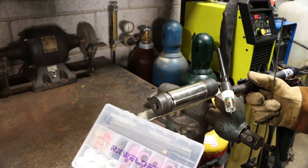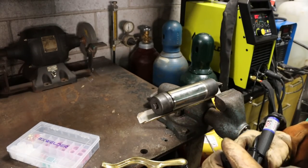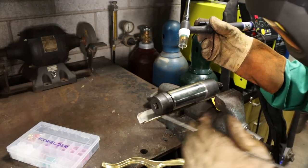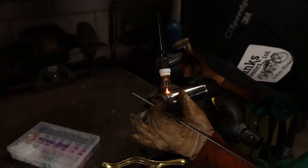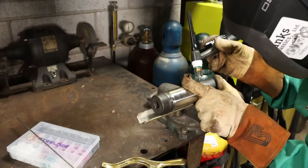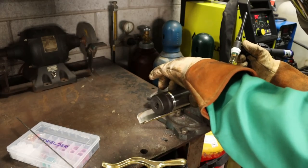This is not an advertisement at all. I picked this up off Amazon — I wanted to try it out. I have very little time on it. Just a gas lens set, a little gas diffuser, some Pyrex cups, some collets, and different torch hardware. If you're new to welding, a few weld tacks placed really helps with giving you a good quality straight job. Everything that's welded warps and distorts; you just have to try to counteract and prepare for it. I'm going around this part putting small weld tacks about 120 degrees apart so those tacks hold it in line when I really start putting the heat to it.